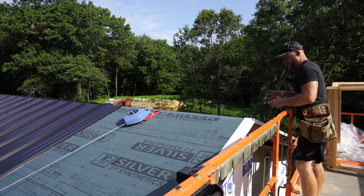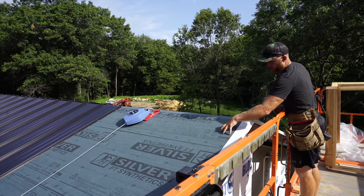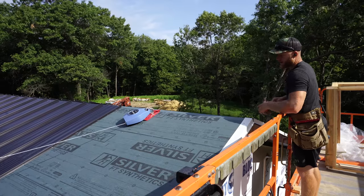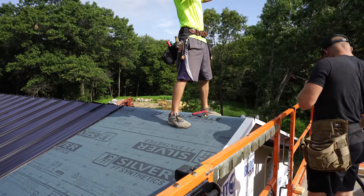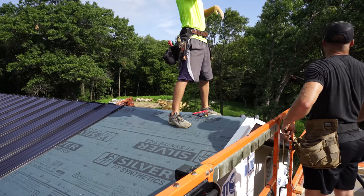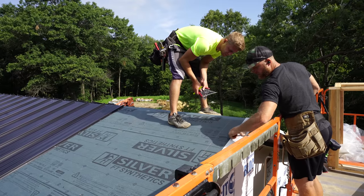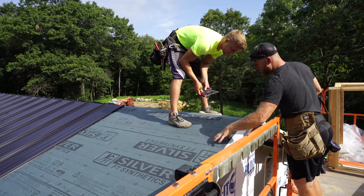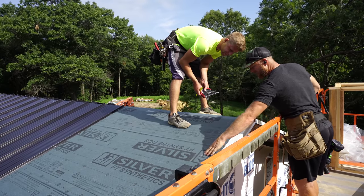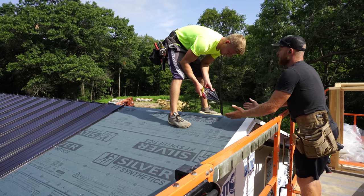Easy-peasy, bro. Leverage. The good thing is, in order to place this, we know what our chimney right below this eave is - it sticks out 16 inches on a two-foot overhang. We're just going to use this line as our reference. It's eight inches off of our edge, which is where we want it. Instead of trying to lay everything out, we're going to go ahead and get it mounted here, then square it up, position it plumb and level.